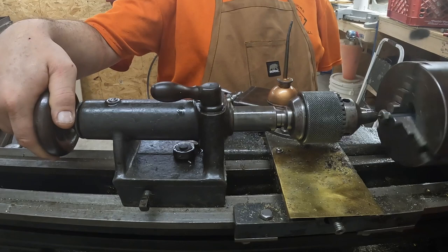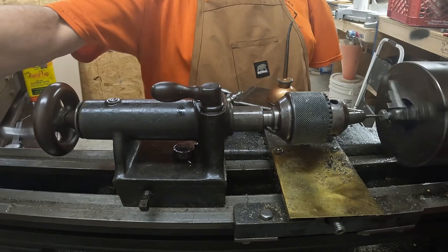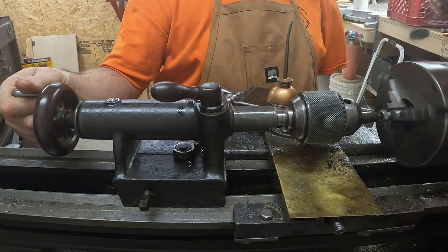Don't let it gunk up too much, because then the drill bit will break inside your piece, and now you've got a really nice hard piece of tool steel you'll never get out of the inside of a piece of steel — plus you've wrecked your drill bit. These are my good drill bits.